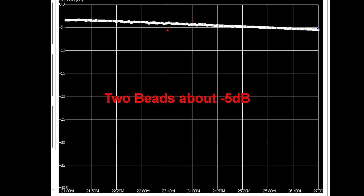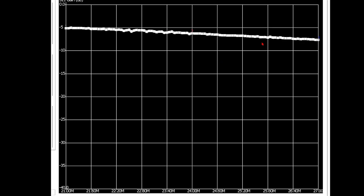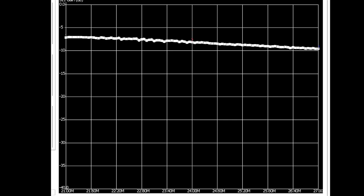It's kind of what I would expect — the amount of change is going to be smaller as it goes along. Okay, there's bead number 3. So roughly 5 to about 7, we'll call it about 6 dB. I'm not looking for precision, just sort of what is it doing. So 3 beads, about 6 dB. Bead number 4 in place, let's sweep it again. That one is about, let's call it, maybe 8 dB.